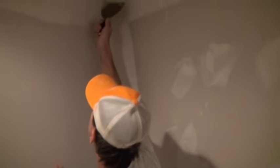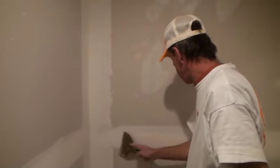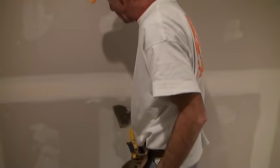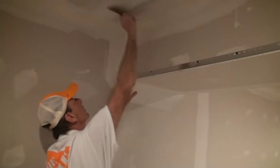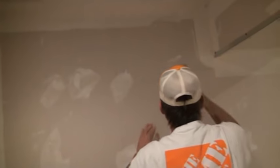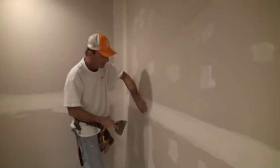In the inside corners, you want to be careful — up in the very corner you can see it's just a little gray, about a half inch of gray there. That's still a little wet, so you want to keep your knife out of that corner. You don't want to drag that mud out of there. Clean the whole way down your joints — you don't want to drag any new garbage into these coats. The cleaner and smoother we put these coats on, the better. Keep in mind, this is just the first of three finishing coats. If you do have a little scratch or burr, don't sweat it — the next coat you're going to clean up your area, get any rough burrs off, and it'll just fill and feather out further.